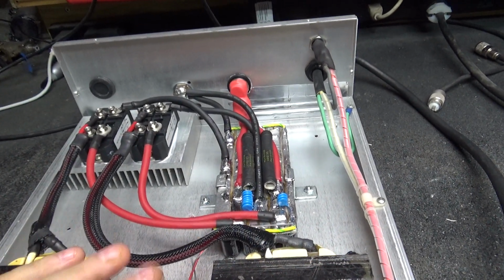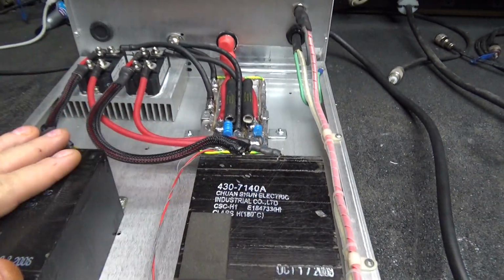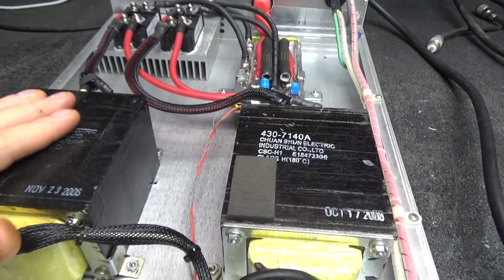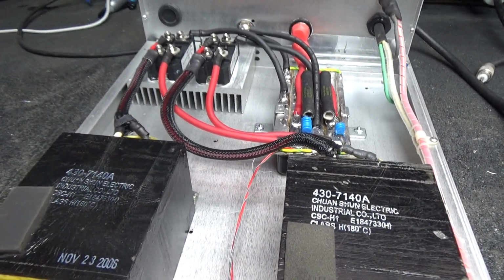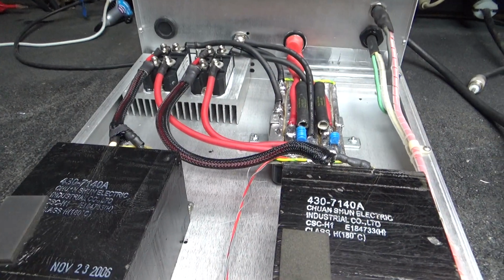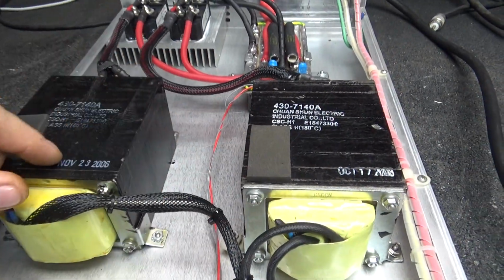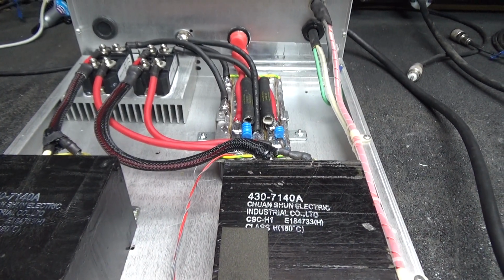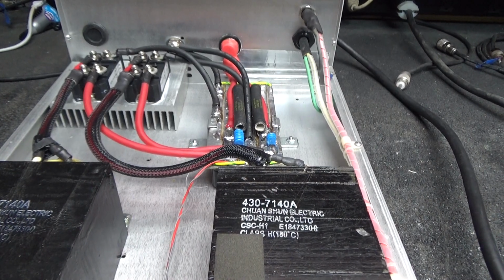Transformers don't get hot anymore. Before, the little transformer was pushing against the big transformer, and this thing was getting pretty toasty. But now they're running together, and these things, they don't even get hot like it did. This 170 was pushing against that one, and they were at a little different voltages. Both of these are set on a medium tap now. On a high tap, it was floating up around 21. Here it's floating 18. It'll pull down.